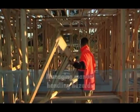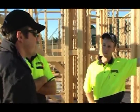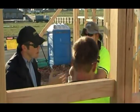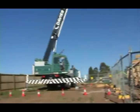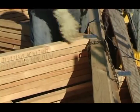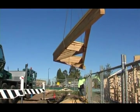Manual handling of heavy loads around building sites can affect our working lives, and it shouldn't. We should be able to do our work and stay safe. So what should we do about eliminating or reducing the hazards of manual handling? Like everything else, if we want to work safe, we have to think and we have to plan. The best thing we can do is to avoid manual handling entirely. Think about mechanisation and using handling aids — for example, we could use a crane. It may seem obvious, but that is the best way to eliminate the risk of manual handling injuries. Use machines.